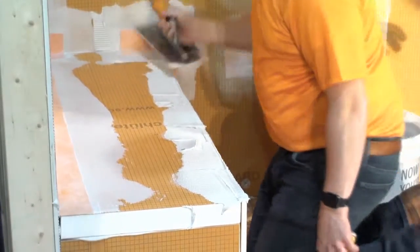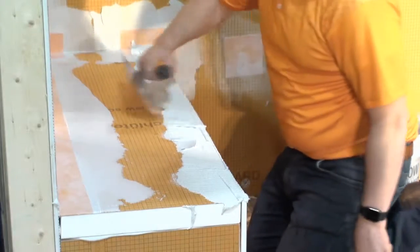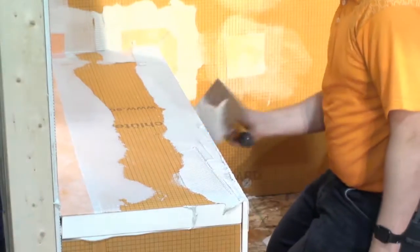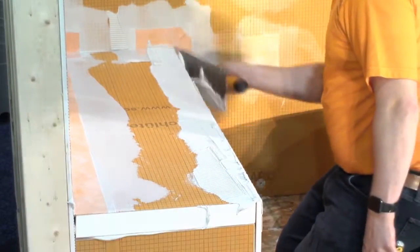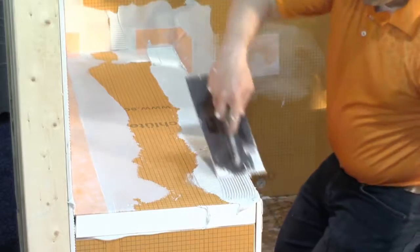If you think about it, if we had to rely on shingle lap for our seam to be waterproof, we wouldn't have much of a waterproof system that we're offering you. So that isn't a requirement. So whatever way you want to do it is fine there. Same thing on the front edge here. Like I said, we want to have a continuous waterproof envelope throughout the entire thing before we get going.